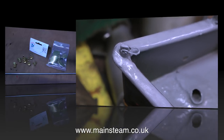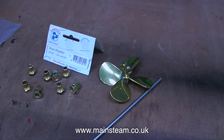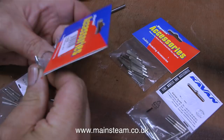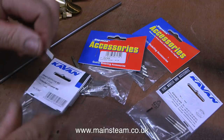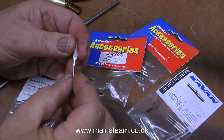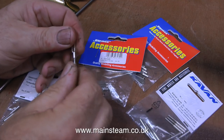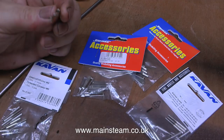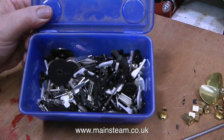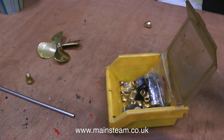Before the video deteriorates into a painting extravaganza, I'll show you these parts. I went over to the Leeds model shop and bought a propeller, some couplings, and some clevices with adapters. These clevices will go from the servos to whatever they're controlling. There are only three items in the boat to control: the regulator, the gas cutoff valve, and the rudder. They'll allow fine adjustments and let me use quite thick push rods so they won't bend. I've put them into my box of radio control bits for now, and similarly I'll put the brass couplings into my box of random brass couplings so I don't lose them.